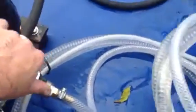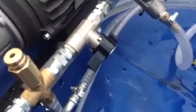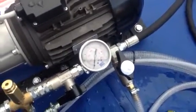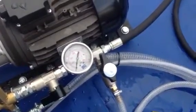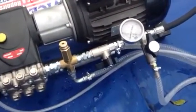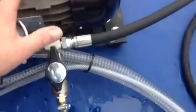So the pipes themselves — what we've done is open the valve here so it primes itself up, making certain that valve is open as well. This is set at the moment at 250 bar. We'll simply close this valve now as it should be primed up.